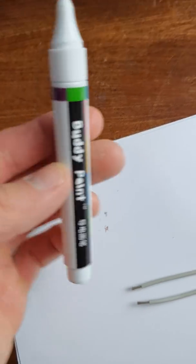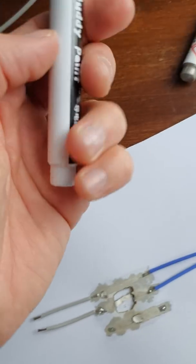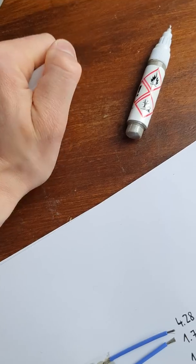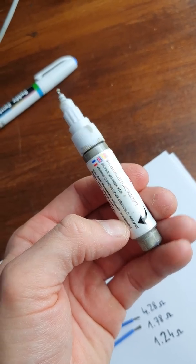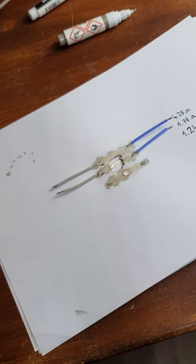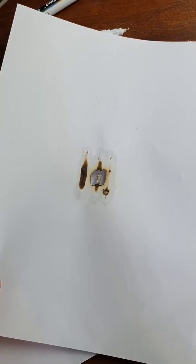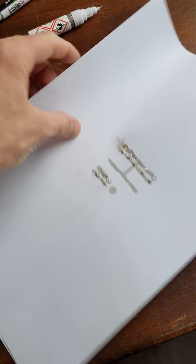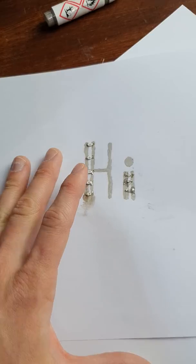You have to shake them. The problem with the cheaper one - which is why I didn't go very far with it while testing - is you cannot solder to it. No matter what I tried, real soldering with a soldering iron or hot air soldering doesn't work, even though it looked promising at first. So I had to go with the other one - a so-called silver varnish conductive pen with lots of warning labels. With it I tried a lot of experiments, like testing the resistance and how much current it can handle. I also tried some applications where I think such conductive ink is useful, like for LED art.